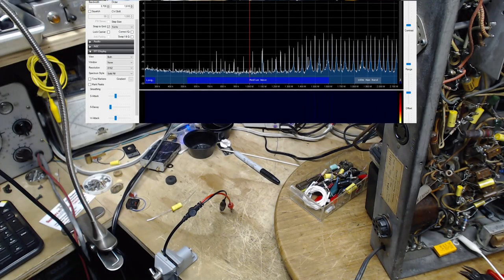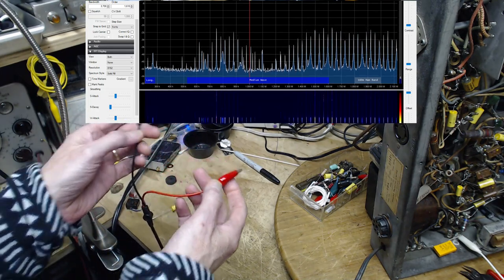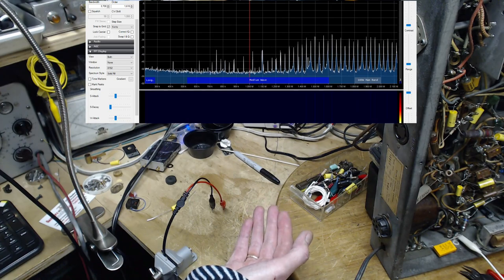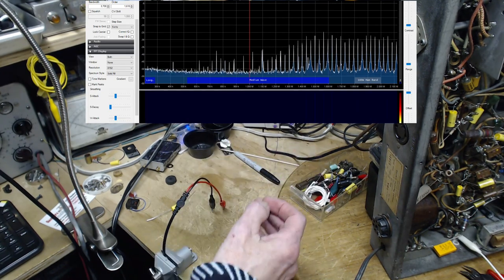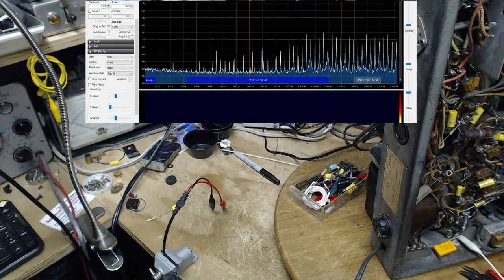You can see my SDR at the top - this is the antenna to the SDR. Put my finger on it and you can see what's going on. From experience in my shop, those noises are way stronger than signals coming in on wire antennas - a blasting amount of noise. It's a little higher at the higher end. I've run around my house with little radios trying to figure out where this noise comes from. I think it's coming from computers and radio equipment in my shop getting into the power system and radiating out of the wires.